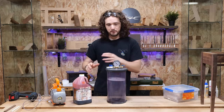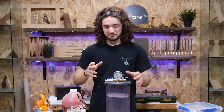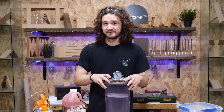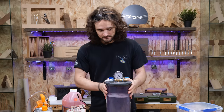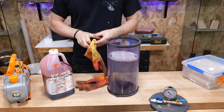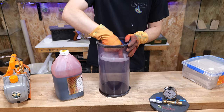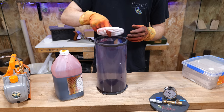It's very important to get a decent quality stabilizing chamber, because with cheaper quality chambers this resin can react and cause cracking — you don't want a thing that could implode full of red resin. I'd highly recommend getting a stabilizing chamber from Cactus Juice; they come in all sorts of shapes and sizes. I'd also recommend getting a pair of kitchen gloves, because while I haven't found problems with this resin contacting skin, when you get it in a cut it is quite possibly one of the worst burning pains you'll ever experience.